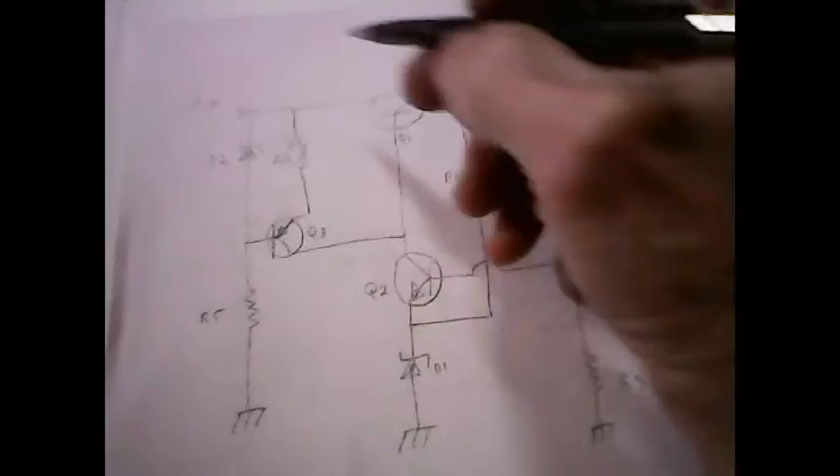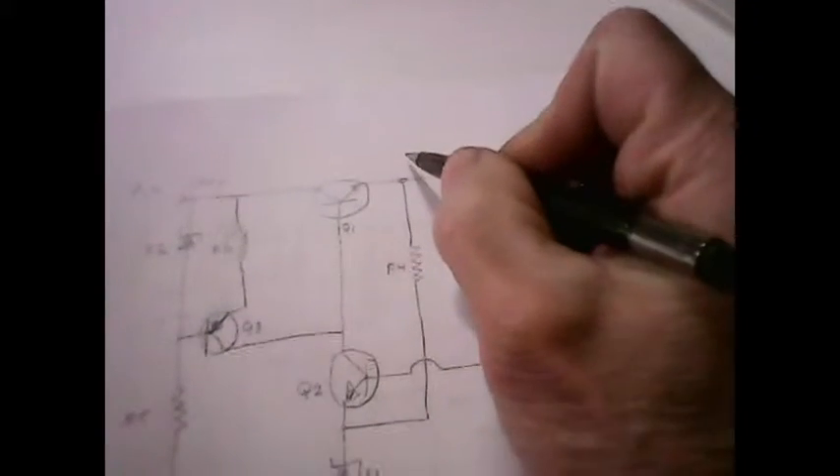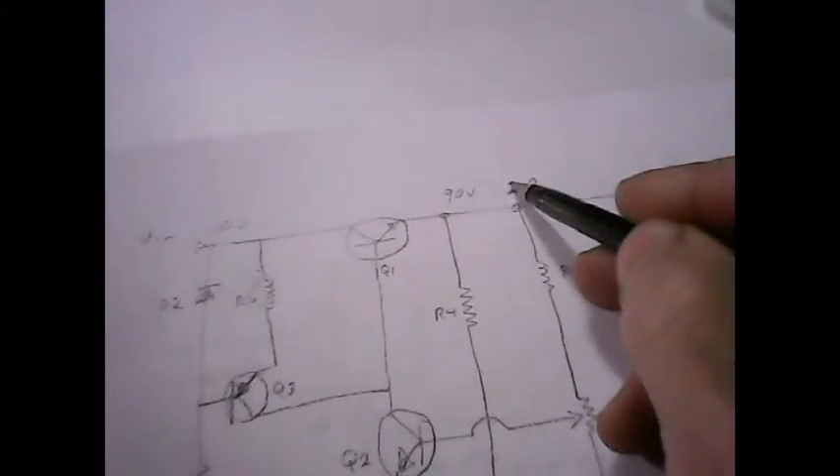I just copied this over here so I can mark my values. The voltage in is about 100 volts. I want the DC voltage out to be about 90 volts after it's been regulated. I'm going to choose a current out of about 2 amps, and that will make up for the heavy loading of 2 amps that we calculated back here.